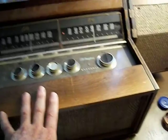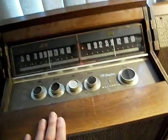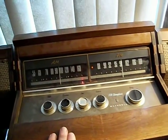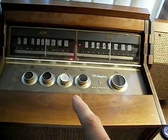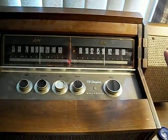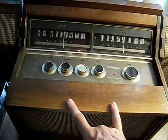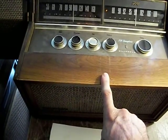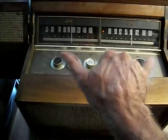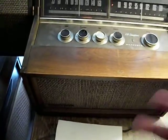There are actually two single-ended amps for the stereo. You've got a 6BM8, which is a triode-pentode — the pentode section of that 6BM8 drives a single-ended amplifier to one speaker. The other 6BM8 drives a single-ended amp to the other speaker, but there's a phase inverter involved, so it switches phase. You've got a phase-inverted channel on one side compared to the other. They're both connected through a transformer to drive the center speaker, set up as a push-pull. So you've got a single-ended amp and an inverted single-ended amp combined through a single transformer to get a push-pull amplifier driving the single speaker. That's really pretty neat.